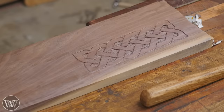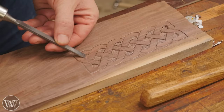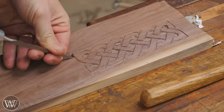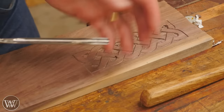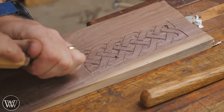Sometimes I'm going to come in here and retrace the bottom of that V-groove with a knife — that will sever all the fibers so I get a really nice clean look to it. Just like that, and this is about another five to ten minutes of work. We've done more of the relief work on this, and you can see how it makes it pop out a good bit more. We've basically outlined around every one of these lines except for on the outside. So I want to do something a little bit more on there. I could come in with a small bench chisel and make small scallops, just relieving this outside edge a little bit more. Or what I prefer is to come in with a small gouge — a tiny little curved gouge — and start back a little bit farther to make these scallops in the edge that pop out a bit more.